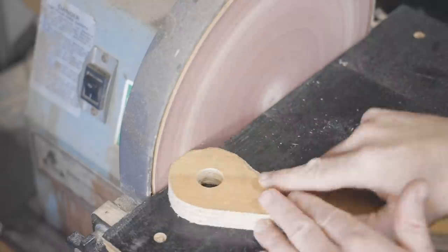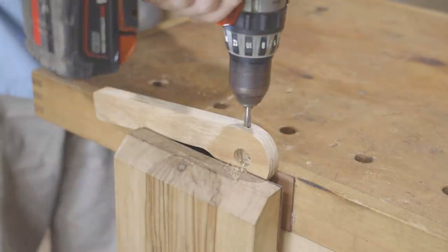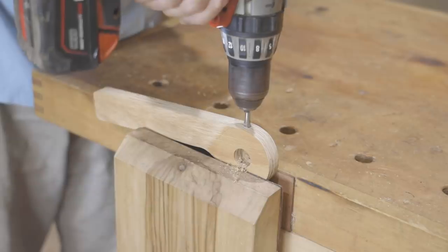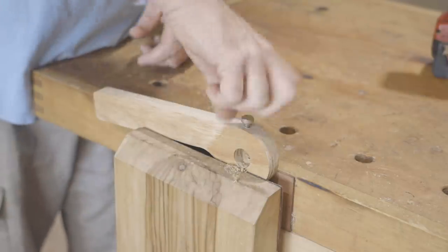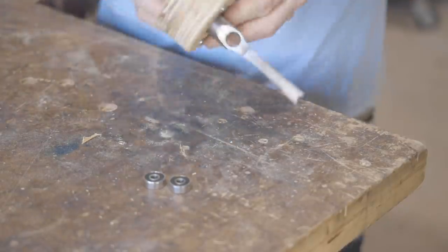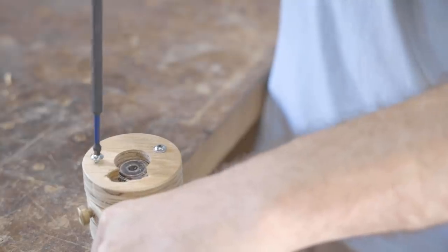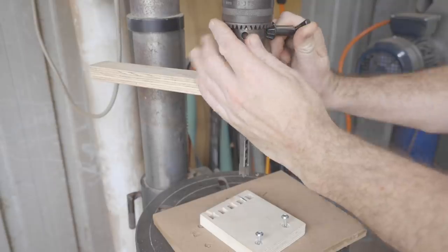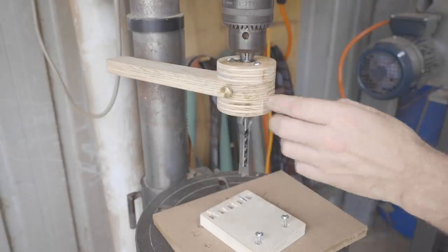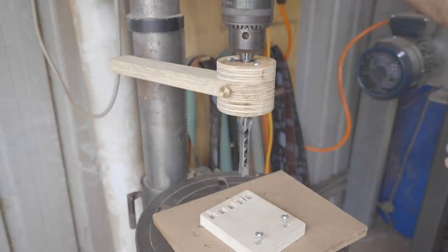I'm also making a couple of rings to go either side of the arm, which are even more unnecessary as they're just there to hide the clamps and make it look a bit better. It doesn't need much at all to stop the bit from spinning — as I showed by holding it lightly with my finger and thumb. I'm going to thread a bolt straight into the plywood and that will be more than adequate. Lastly I'll screw those totally unnecessary rings to the top and bottom of the arm. The arm is just to keep the chisel in the correct position — when it hits the pillar of the drill it can't go any further. It's wobbly, and like I say this will only work with the template; you wouldn't be able to make an accurate mortise with it.